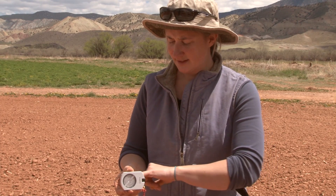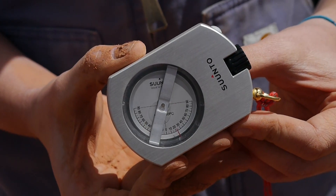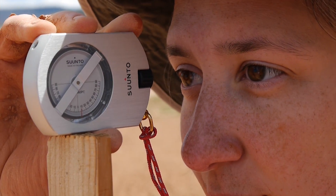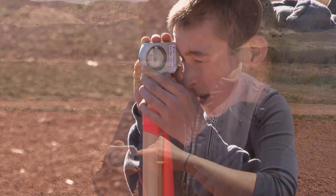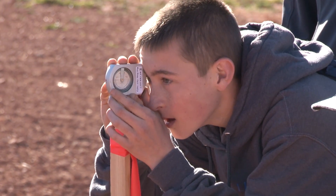The other tool we can use to measure slope is a clinometer, which is a little more modern than the abney level. Instead of having a mirror with a level bar reflected into your eye vision to line up, this one has an internal dial. As I rotate the angle of the clinometer it rotates the meter on the inside. The trick with looking through the clinometer is I have to keep both eyes open — one eye to see the meter on the inside and the other eye to make sure I'm lining it up correctly with the stake.